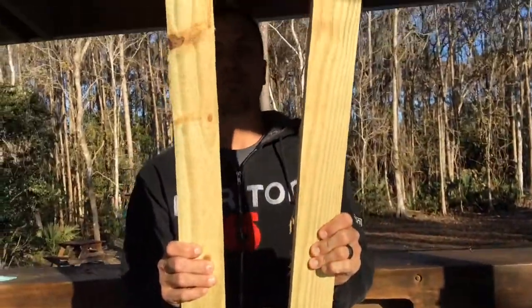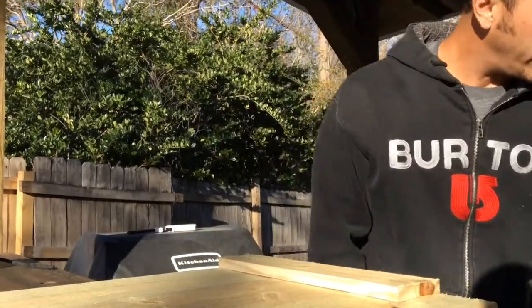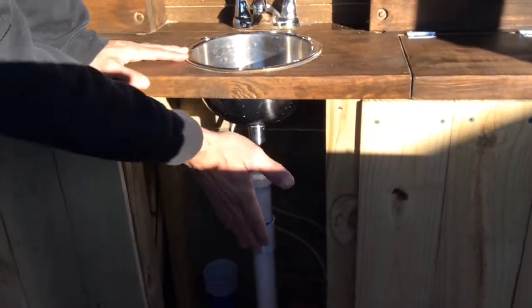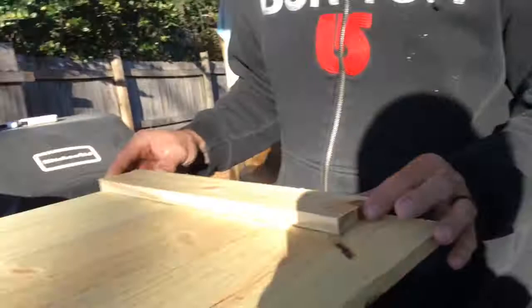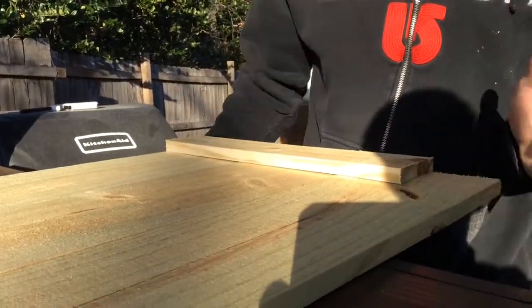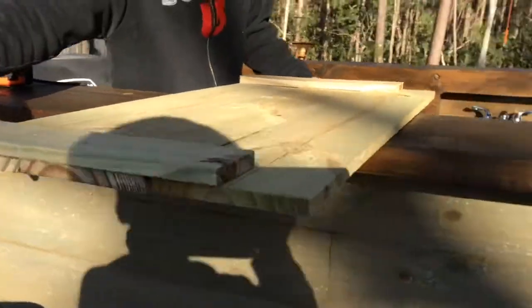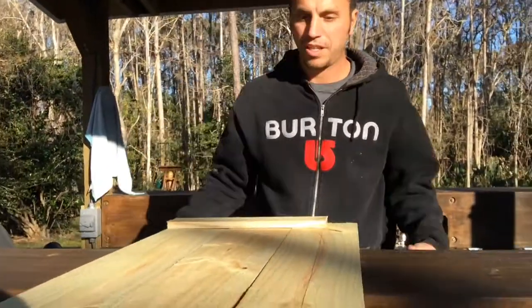So what I did was I split another fence board, and I'm gonna use it to frame out my door. Down here you can see that there's a space. My plan is for the door to shut and have one of the boards shut there. I'll put the barrel latch. Up here, you can see I cut these to allow enough space for down there. So I'm gonna fasten these two boards, then I'm gonna do a diagonal board for support. It should be good to go.